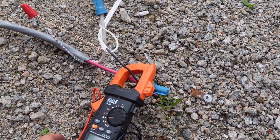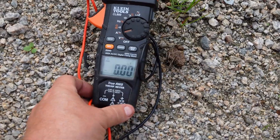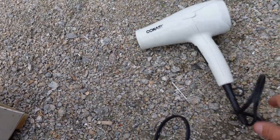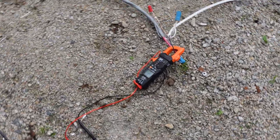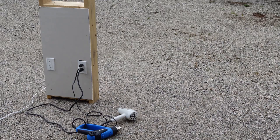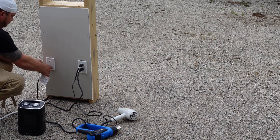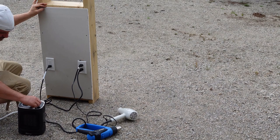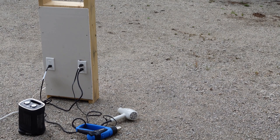We're going to clamp an ammeter around the wire so we can clearly see what it's pulling in amps. Let's go ahead and plug our hair dryer in and turn it on. We are pulling 1.49 amps — well, that's not very much. I'm going to have to step up my load substantially, so I got a 1500-watt heater to plug in along with a heat gun and hair dryer. This is actually over 3000 watts on this 15-amp circuit. With all three plugged in, we are pulling 28 amps — but I don't think it's going to be enough.